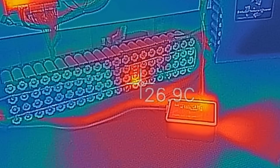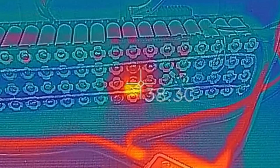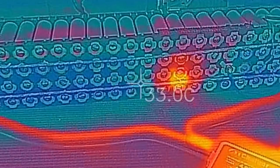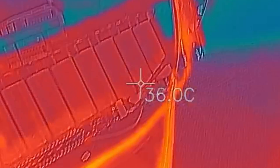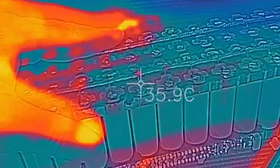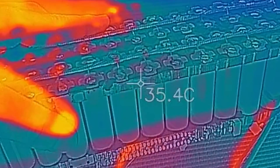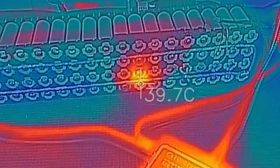It turns out there are actually three ways to do this and I didn't even pick up my thermal camera. That hot spot isn't much hotter — about 40 degrees — but moving off to the left it drops to 32 degrees, about seven to eight degrees cooler. Disconnecting the charger you can definitely see there's a hot spot. It's interesting to note that I can't feel anything more than the slightest temperature difference with my fingers, yet it's extremely obvious on the thermal camera that we've got an issue.